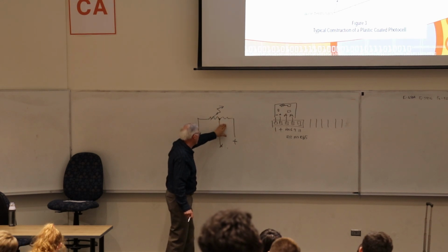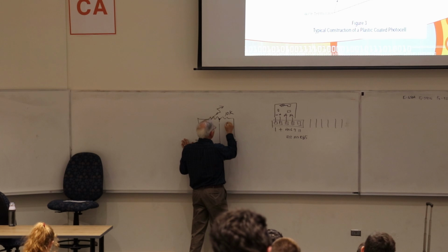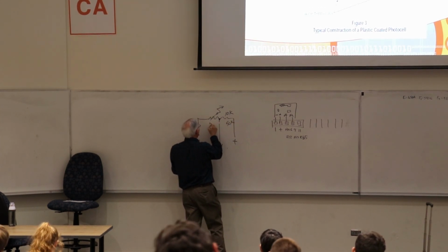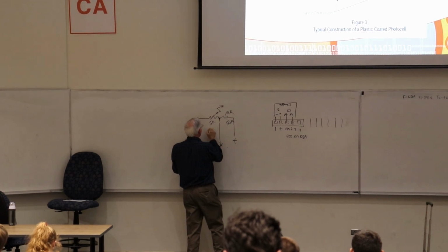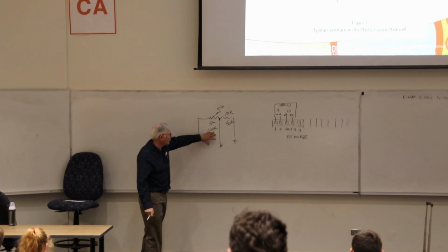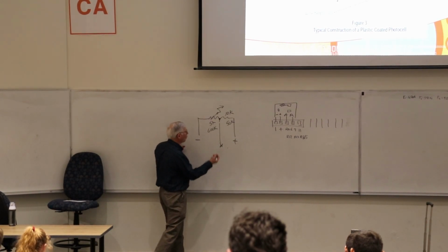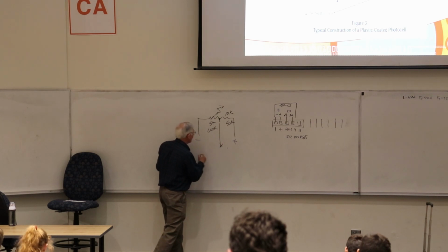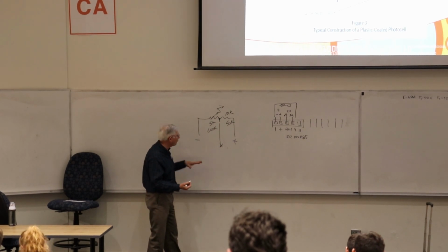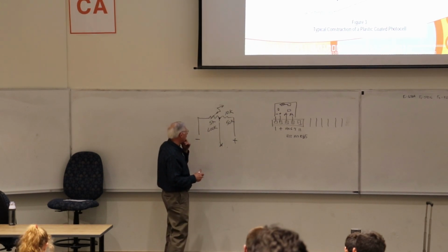This resistance is fixed. And I think it varies. I think this is 10K, or maybe we did 50K on some of them, I can't remember. And then this varies from maybe 5K to maybe 600K, something like that. Totally dark, 600K, really bright, 5K. So you can see it's not going to go all the way from 0 to 3.3 or 5 volts. It's going to just do a part of that range.